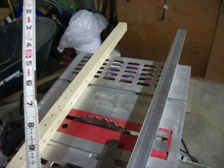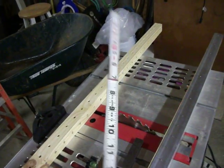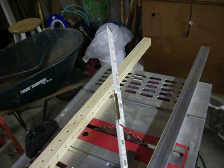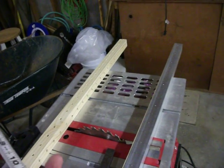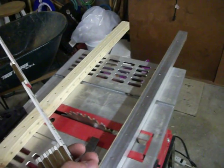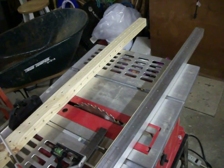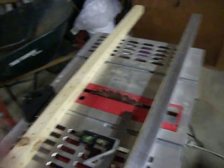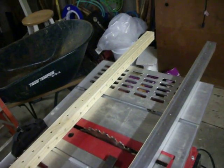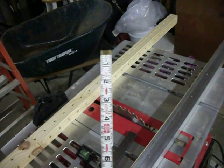The tool I ended up resorting to for measuring — and I still use this to check — is a carpenter's rule. This thing folds out to about six feet and it's better than using tape, because at the end of a tape measure, the stopper's rivets will actually come loose after a while, so you won't get an accurate measurement. While the tolerance with grid beam, especially wood grid beam, is pretty high, if you're building something that requires accuracy like a piece of furniture and you don't want it to wobble, it's very important to have accurate measurements. I recommend one of these highly.